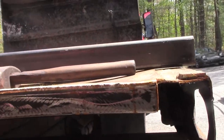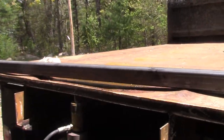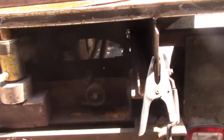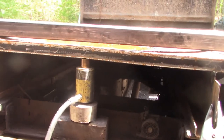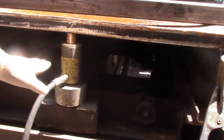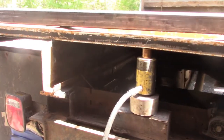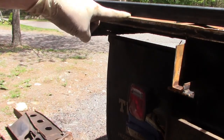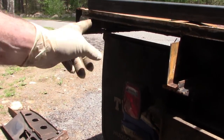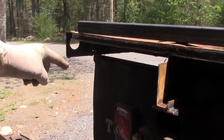I can put this rear cross member in that I've roughed in, and then I can start working on filling it in between here and here with some additional box tubing and put the provisions in the rear bulkhead, if you will, for the triple center marker lights, and then I'll work on the wings that come off and put the holes in that material for the rear turn signals and brake lights.